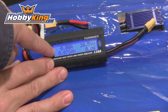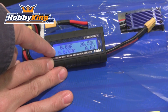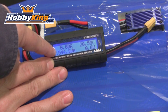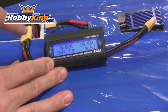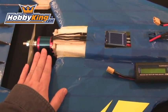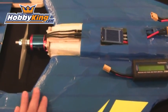The lower part of the display records the maximum levels for each reading that you can review after the power test. As you can see, it records the voltage drop — it started at 20.5 volts and under full power it dropped down to 18.3 volts. This is a good way to judge if you're overworking your batteries, and by checking the watts you can verify you're within the range of your motor and ESC with the amps. In this static bench test the motor proved to be under the 1600 watt recommendation by the manufacturer, and I was under the 100 amp recommendation for the ESC — it was only pulling 84 amps. Without this tool I would be doing a lot of guesswork on sizing the prop to stay within the manufacturer's recommended settings.